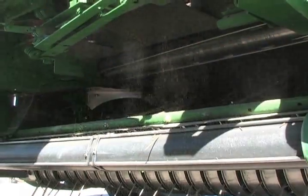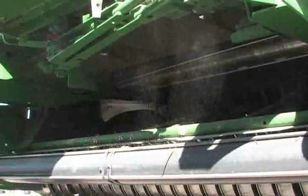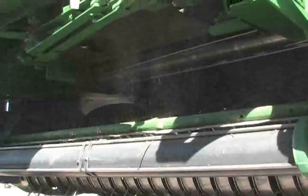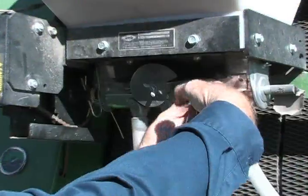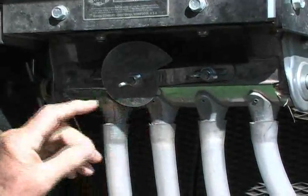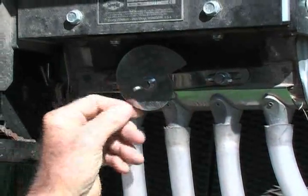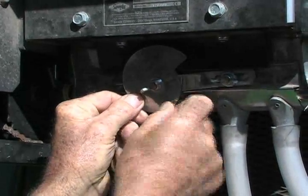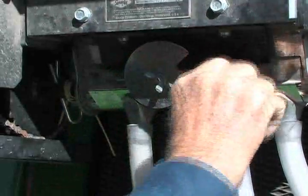It's operated with a toggle switch in the cab of the tractor. When you start your bale, you turn your switch on, and when you finish your bale, you cut it off while you're wrapping, and it puts a uniform layer of the powder mix into the bale. To set and change the dial, it was set on thirty-three — to go to thirty on your dial — and that's all you have to do to change it.